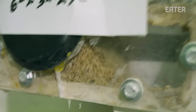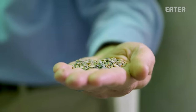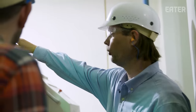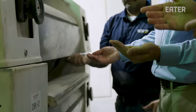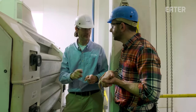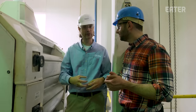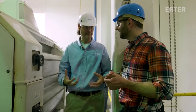The first step in milling is a bigger version of the testing machine, meant to take out everything that isn't wheat — mostly rocks, sticks, and corn. All wheat goes through this machine. This is called our first break — it takes the whole kernel and breaks it once. Another set of roller mills does another pass. Two rolls move together with the product going through the middle; one roll moves slightly faster than the other, and it also has a texture to it. Because one's moving faster, it creates a shearing action, making nice flaky bran that's easy to work with in the mill.